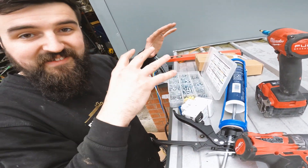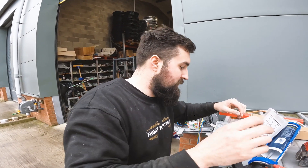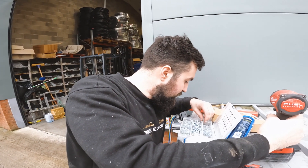If the neutral disappears to the property, the return path is the earth, so anything metal would come live essentially. If you're going to be touching a car every day, you're going to get a shock. That can happen if they do some road works and the neutral severs for the building but the line cables are still there. That's the whole point of PEN fault detection - to stop a big human shock sat on your drive.